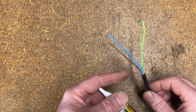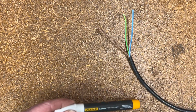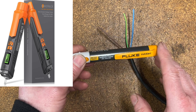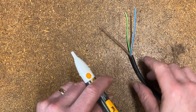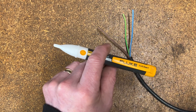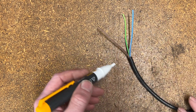So we'll switch this on. This is powered off at the moment — it's just a bare cable. Powered on at the mains. I don't want to be touching the coppery bits of the cable. You may have seen an earlier video where I had a similar tool which was rubbish, basically — about £15 from Amazon. It looked really good, had an LCD display, all sorts, but it was very insensitive. You'd be able to put it on this cable and it would show live, and put it on the neutral and it would also show live. So I'm hoping with a Fluke, being a really good product, it's going to be a little bit more sensitive, because if you're in a fuse box the wires are all very close together and you're not going to be able to differentiate between a live and a dead wire so well.